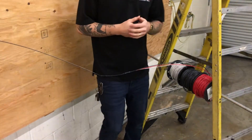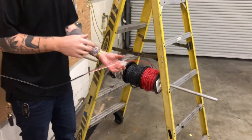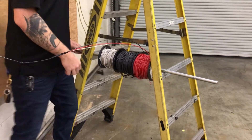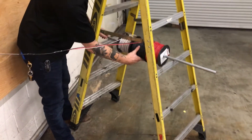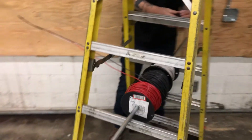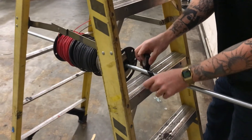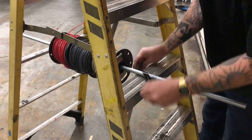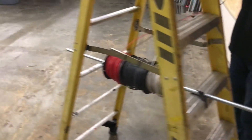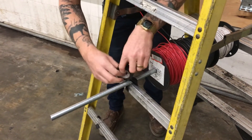One thing about the wire being on the ladder is that as you're pulling, especially when you're by yourself, the spools are going to move around. You can also run into trouble with the spools hitting the legs. So what I like to do is set up the wire about halfway into the ladder — that way the spools don't have any legs to get caught on. I'll actually tape the conduit to the ladder. This ensures that while I'm away on the other side pulling, nothing is going to move. You'll use this practice as well for multiple-person wire pulls to make sure the wire stays where you want it.